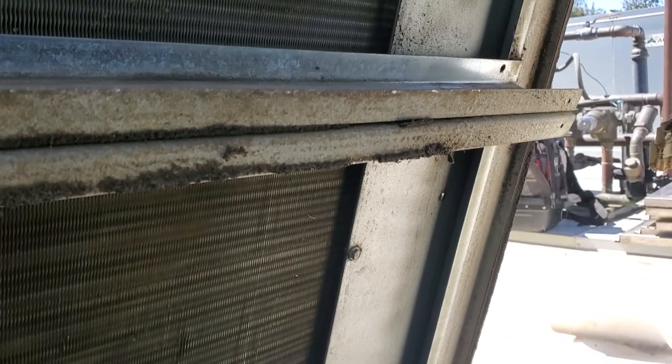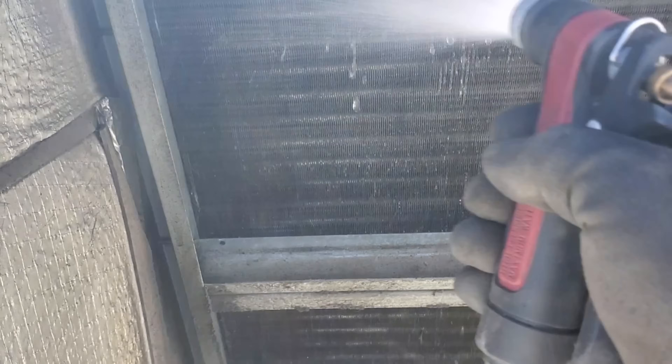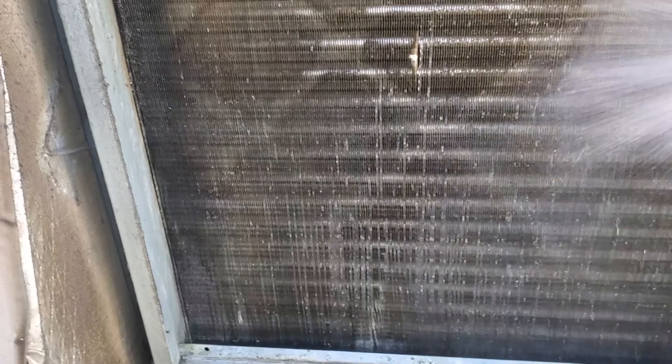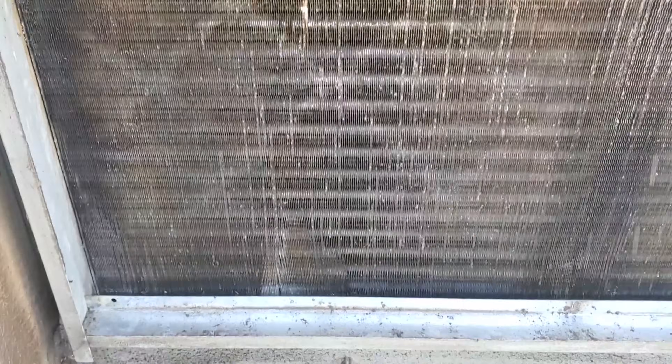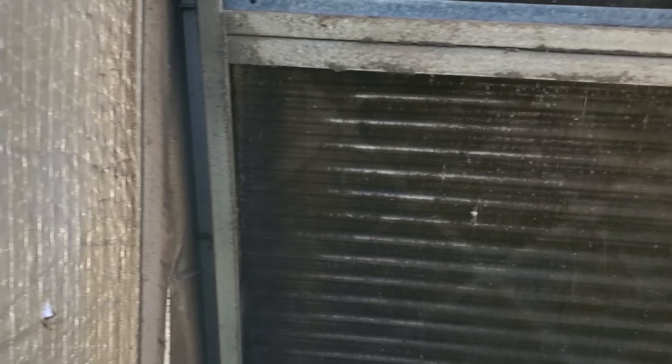If I was smart, I'd go get my vacuum, but I'm a little lazy and I don't think I'll need it. Let me get some water on this guy — give it a quick little wet-down just to make sure we have a smooth surface for the coil cleaner. You see how it kind of went down like that? That's because I didn't have it wet enough down here. You've got to work it from the bottom up slowly. As the coil gets lubricated, it'll stop falling off. Notice that time it didn't really fall off — you just got to do it a little bit at a time, but the coil needs to be wet. There we go, that's doing better.